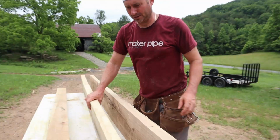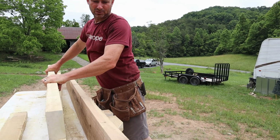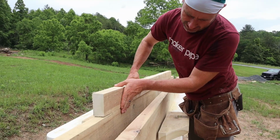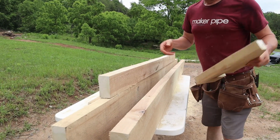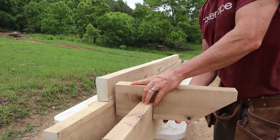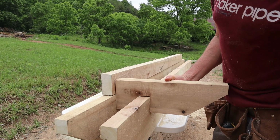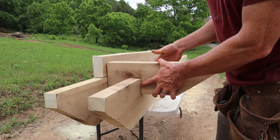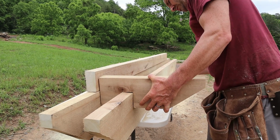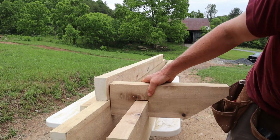So here's the back plate. That gets attached to the wall along with this guy here. It overhangs like an inch this way. And then you come along with this, click them into place like that. And then he's gonna line up like that. And we'll do that all the way down. We're gonna paint this. We'll caulk this before we paint it. But it'll look nice and inset. All right. Looks good.